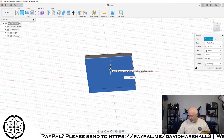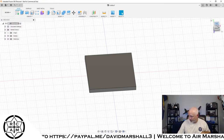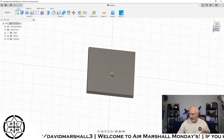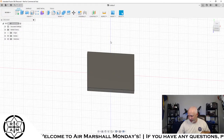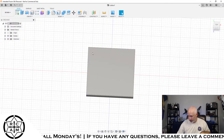We're going to make that a 2 millimeter base. So we're going to do 2 millimeter walls on this one, because it needs to be a little bit tougher. The VTX isn't going to be getting whipped around or anything. This one is, so we'll go with a little bit tougher walls.